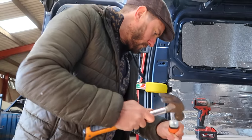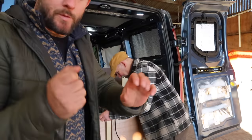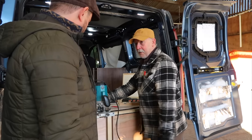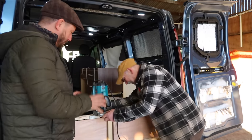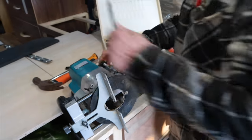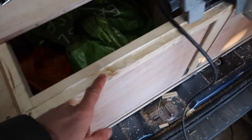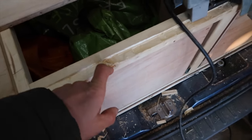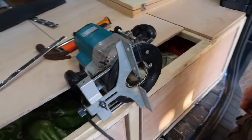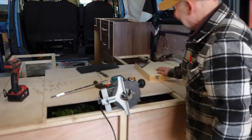Not just a pretty face. So this is two ways to do it - the way I was doing it, which is taking a long time just with chisels. Then Bill came over and said this is the way you want to do it - router setup. You set your blade to the top of the surface you want to trim out, set zero to that plate, and you can set the thickness of what you want to take out. There's me gnawing at it like Woody Woodpecker trying to get through all these knots, and that's set up ready to go in no time. If you've got the right tools and know how, you can make this job a lot easier.